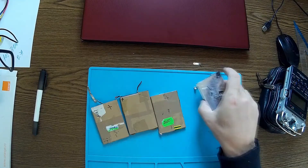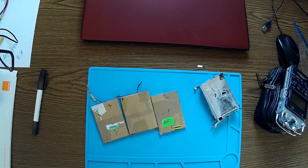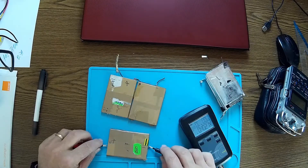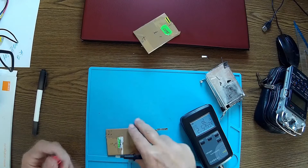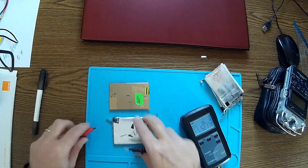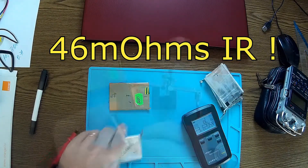The elements are ready — they've been charged and checked for capacity. I have three of them with almost the same capacity: 73. A little bit lower than the others. Now I have to choose, so let me check the internal resistance first. 73 — this one goes out, out of question. 44.7 — I'll take this one. Let me check one of these others: 46.1 — okay, that's fine.